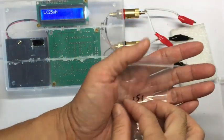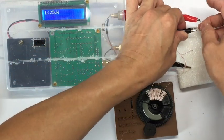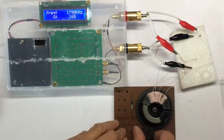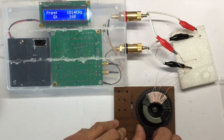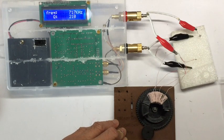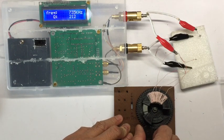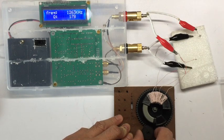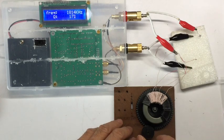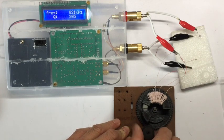Next, let's switch to a lower capacitor of 150 pF — also a 10,000 Q surface-mounted fixed capacitor. So let's test the Q-factor. When it's all out, Q-factor is around 170. When it's all in, it rises to around 210. This can be repeated consistently — 170 to 210. Not bad. The Q-factor doesn't drop as dramatically as expected when the ferrite ring is pulled out.